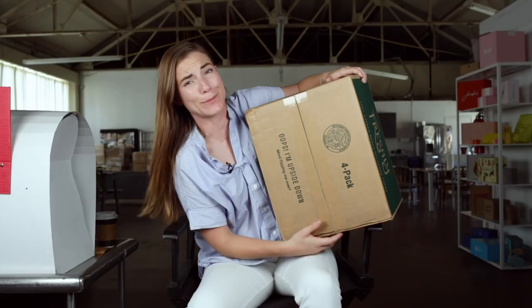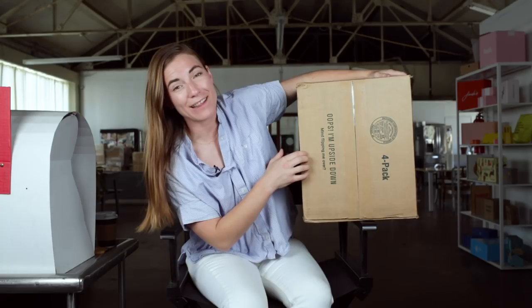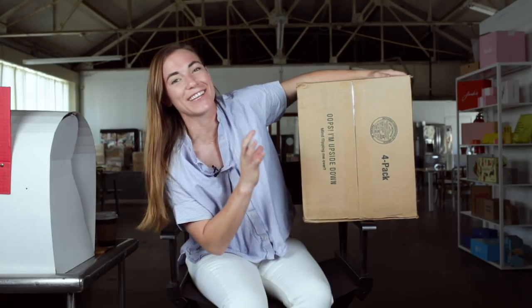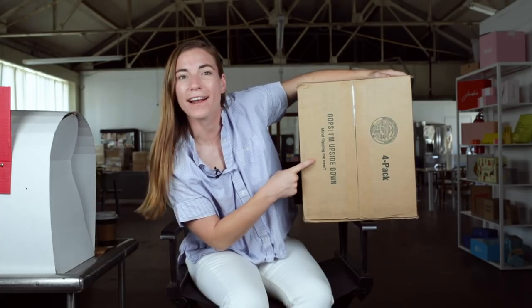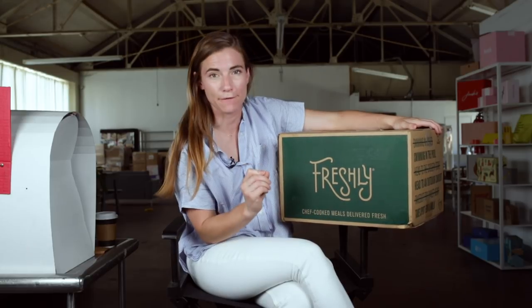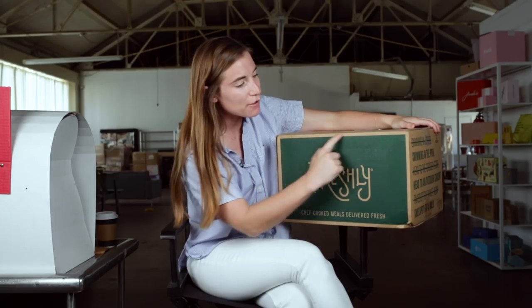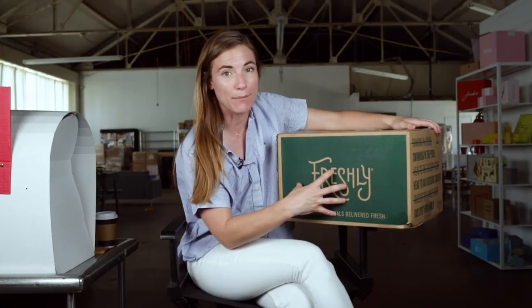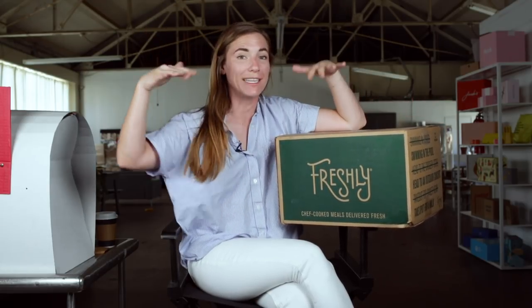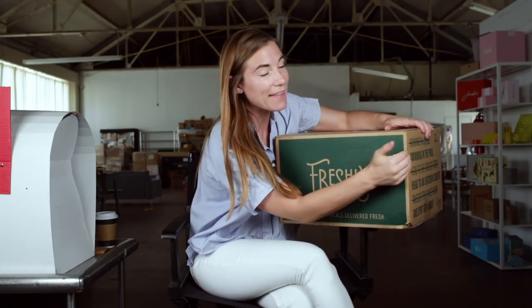On the bottom you can tell I ordered a four-pack. It says — whoops, I'm upside down — 'mind flipping me over?' I like this a lot. Humor on the outside of the box always gets me, because I truly understand the nature of logistics and supply chain: men and women all over the world need to carry this to you, and you've got to make them laugh. Now, the pre-press designer gave themselves a little bit of wiggle room, which looks like a frame on the outside of the green logo panel. This frame is slightly smaller on one side than the other, accounting for the shift in production that a flexographically printed box is bound to experience. These boxes are printed on huge machines — the box is flying under a printing roller at really high speeds — so by giving yourself this frame, you make sure the print won't slip off the edge and go around the corner.